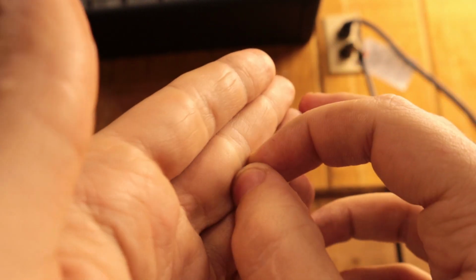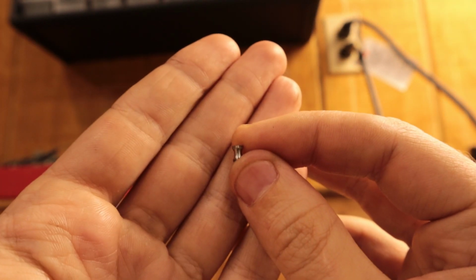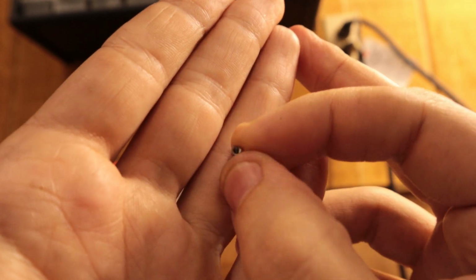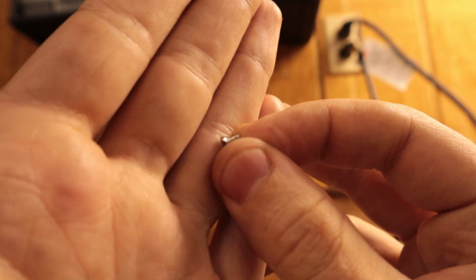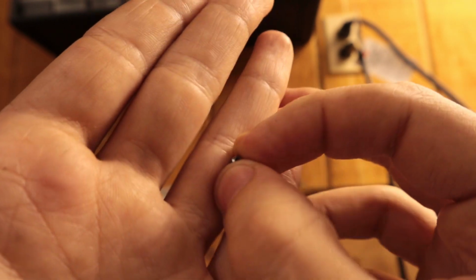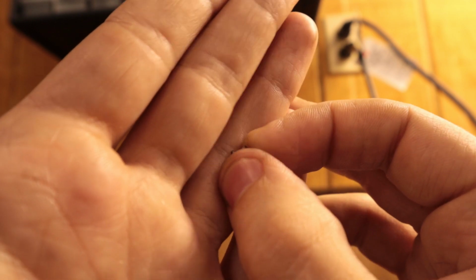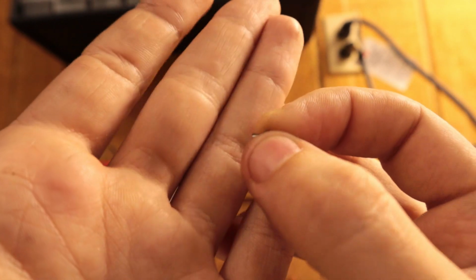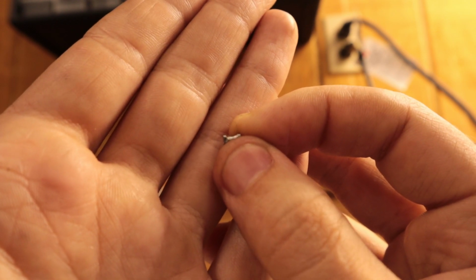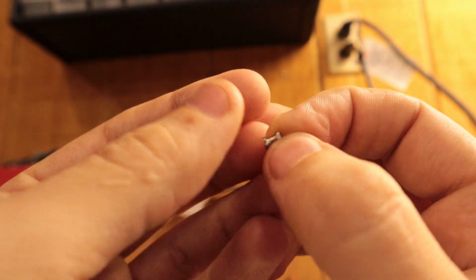So I chamfer it on the main and the sub, and they're pretty much dead nuts length, very consistently, like within 2/10 on all of them, which is pretty wild. And then even the square itself is within like 4/10, 5/10, which is really awesome, actually. I wouldn't think the machine would be able to pull that level of precision off, but I'm happy that it does.